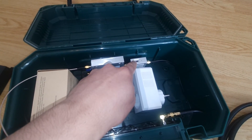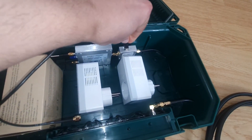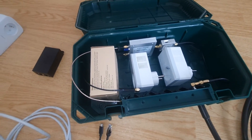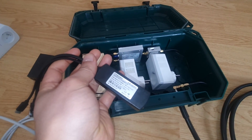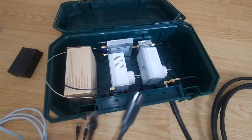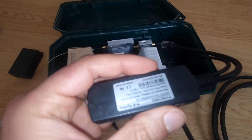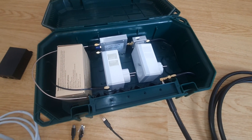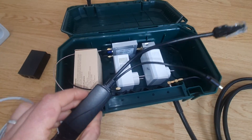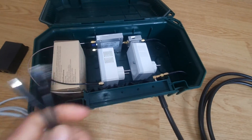To power the amplifier you need a DC injector at 5 volts — this is a micro USB that fits here. To supply 5 volts I use a PoE splitter. The PoE splitter has a USB-C output — I will cut it and replace it with a micro USB. This PoE splitter gives me 5 volts DC power. I'll do the same for my miners using a PoE setup.